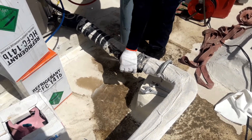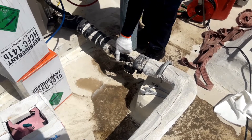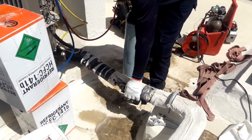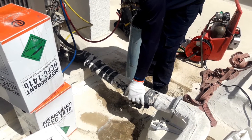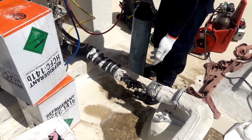You can see now only air is coming out in the sequence — this means the flushing is done. We can close our nitrogen pressure. Flushing is done.